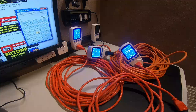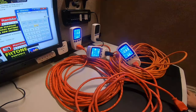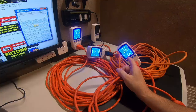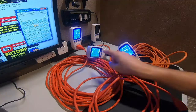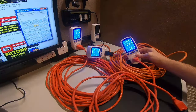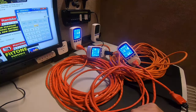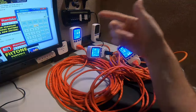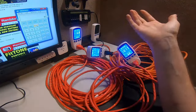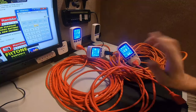A bigger cable will help, but you still have voltage sag — that's a very important thing when running cables. We're down to 107 now. This is a purely resistive load, which is the only reason I'm doing this with a heater. If you had expensive equipment on the end of this, it's already dropping to 116 at the first meter and all the way to 108 by the time it reaches your equipment.